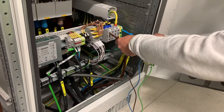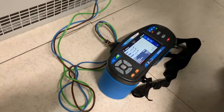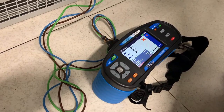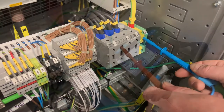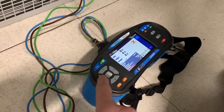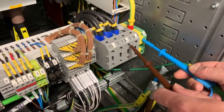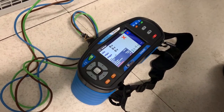We can hit the question mark which shows us how to connect the meter. We start with the first test L1 down to earth — there is no neutral connection on this panel. Then in turn we go L2 to the earth connection and do a test, and finally L3. From the results we can clearly see there's no voltage on the panel.